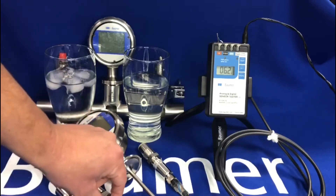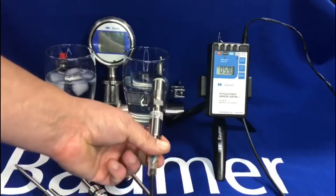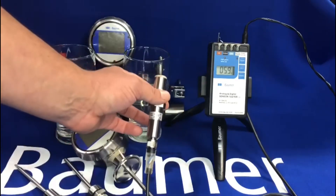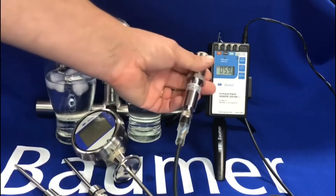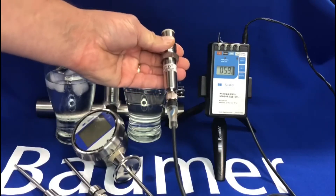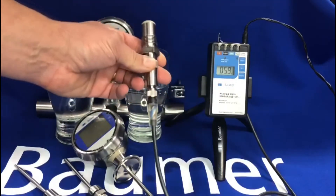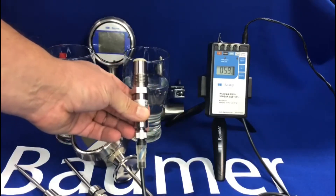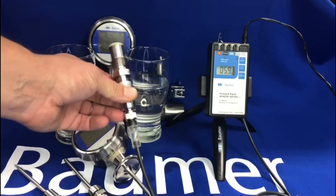For the experiment, I've got our TR8 flush sensor, some cold water, and some hot water. I've got this hooked up to our sensor tester to show the milliamp output. There is a 4 to 20 milliamp signal set up out of the factory as 0 to 120 degrees C. At the moment we're reading around about 6 milliamps in ambient air. I want to show the difference in response speeds, in particular with reference to our new very fast reacting PT20, which we'll come onto.